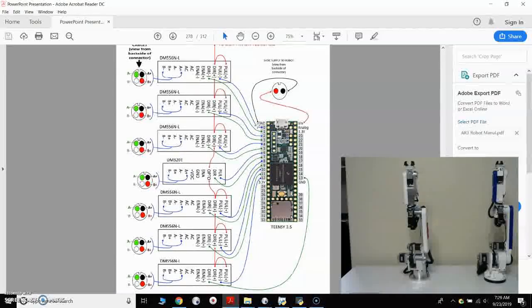Now if you click jogging in the negative direction and the positive direction, and both buttons make the robot go the same way, then the robot is generally not getting this direction input, the green wire. So check all your connections on the green wire. And another thing: if the motor is making kind of a growling noise but not moving smoothly, like it's stuttering and growling and making some funny noises, that is typically when these A-B wires are not wired correctly. If you have one of them crossed over, an A to a B or a B to an A, the motors will tend to run very, very oddly. So those are a couple of things to check.